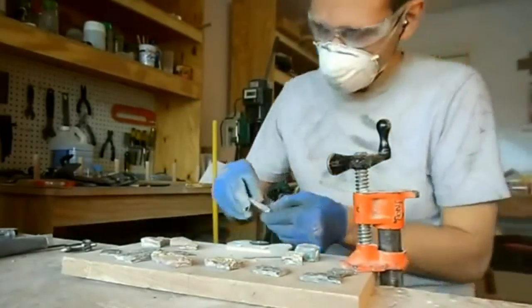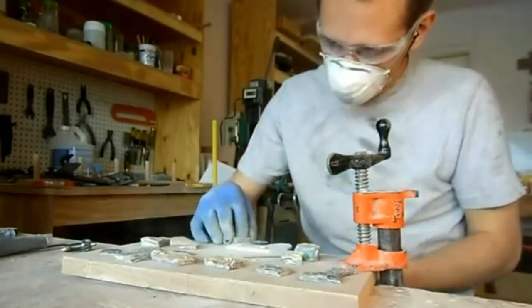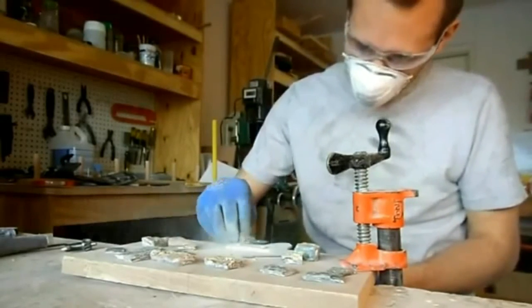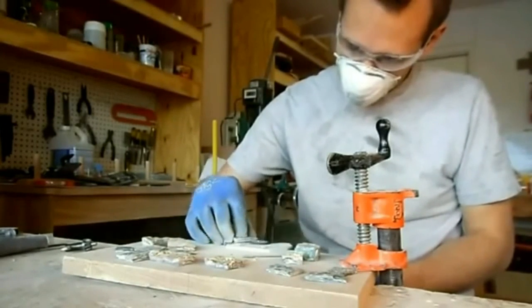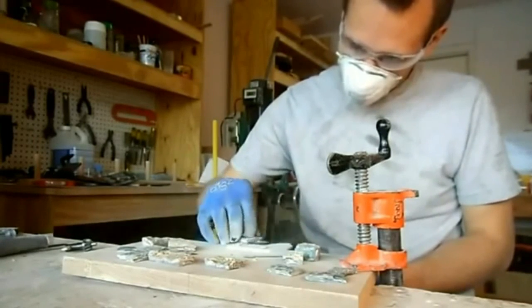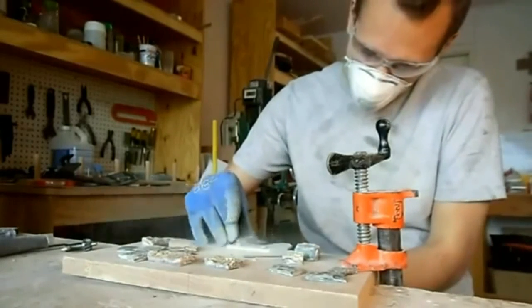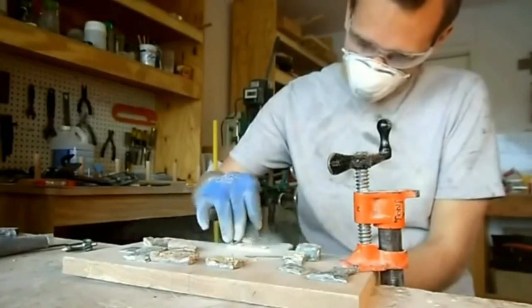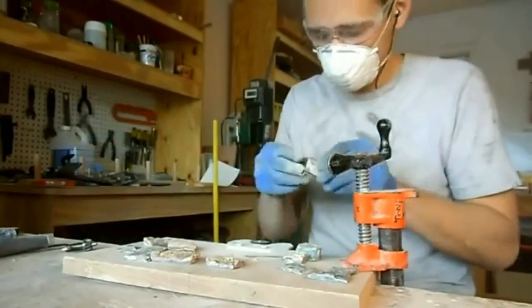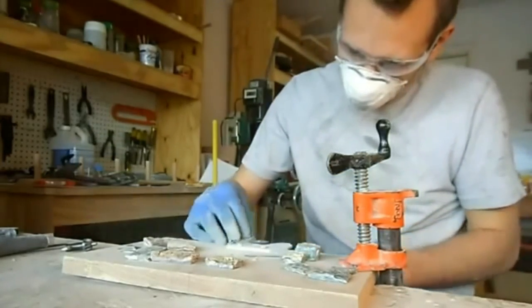Bigger pieces are naturally more useful if you need a larger piece. Really this process is about just getting your flow and working one piece at a time, and just paying attention to what you're doing. One blank should take about two or three minutes to cut. Don't force the piece of pearl onto the disc too hard or it will slow the Dremel down and you'll make less progress. Here I've done two or three pieces of pearl — I get quite a bit of dust honestly. These are my two pieces of red abalone, and after a while these are the pieces that you'll get. Some quality pieces — and honestly it's just a great deal. But again, be safe and please use protection.